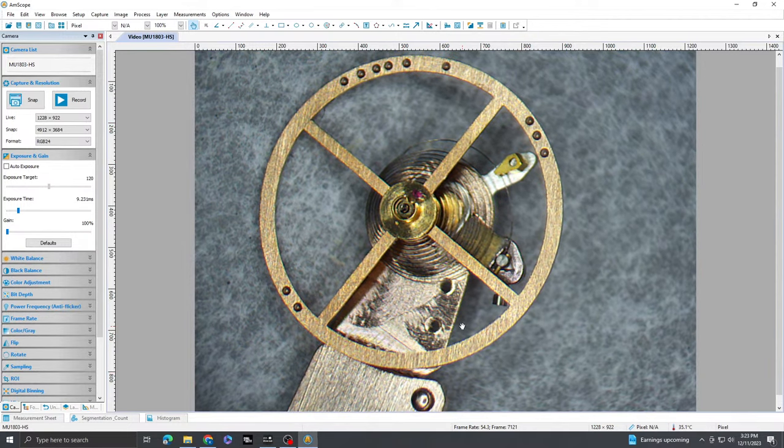Now, they could have been doing this. Usually, you want to manipulate the hairspring as much as you possibly can and get that absolutely perfect. Because if this hairspring isn't perfectly centered, up and down, left and right, it won't keep time in different positions, dial up, dial down, all that stuff. So crown right, crown left, crown up, crown down. What they were trying to do is remove weight from the balance because in these positions it was too heavy and they wanted to speed up that certain position. First thing you want to do is the hairspring. That's absolutely key. You have to.